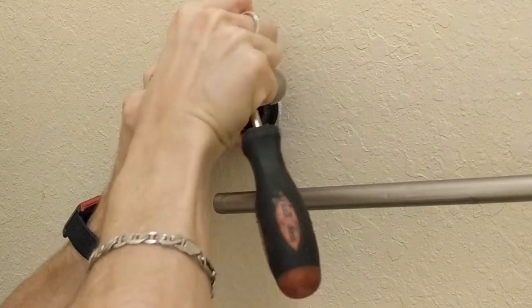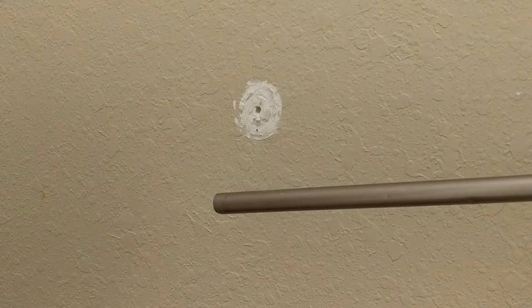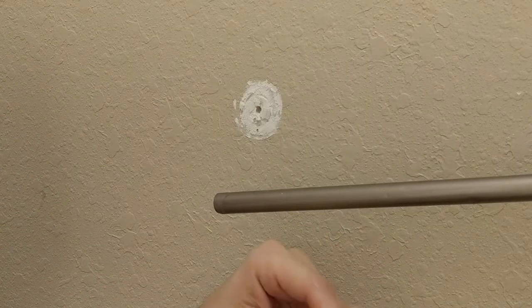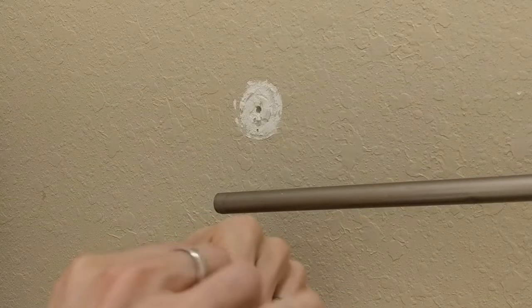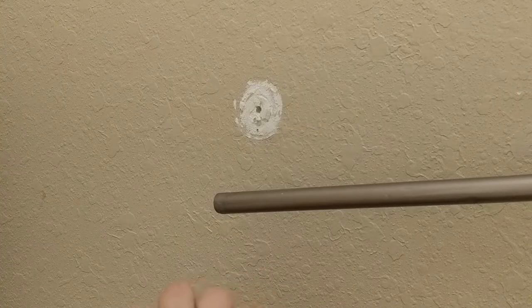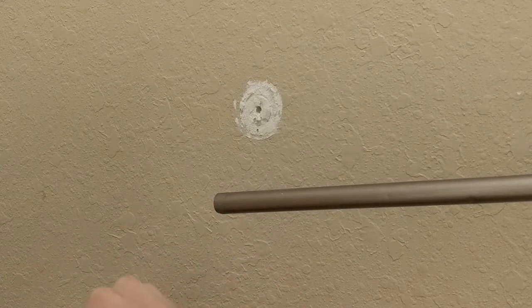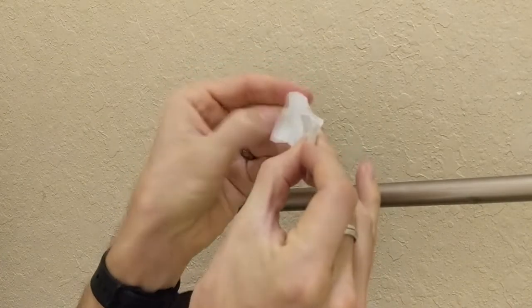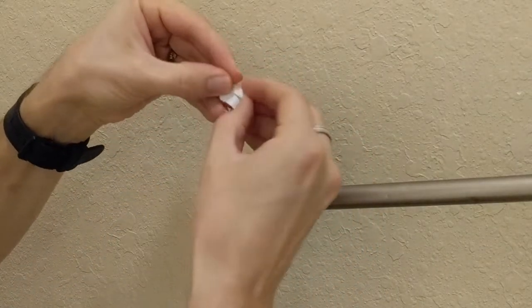Right now it came out because kids have been pulling on it, and it needs a little extra something to keep it from being pulled out again. Here comes the part with the paper — we're going to take a strip about an inch long and tear it down a little bit to get a smaller strip. Then we're going to roll this pretty tightly. We've got a bigger screw so I'm going to grab a little bit more and just roll this together.